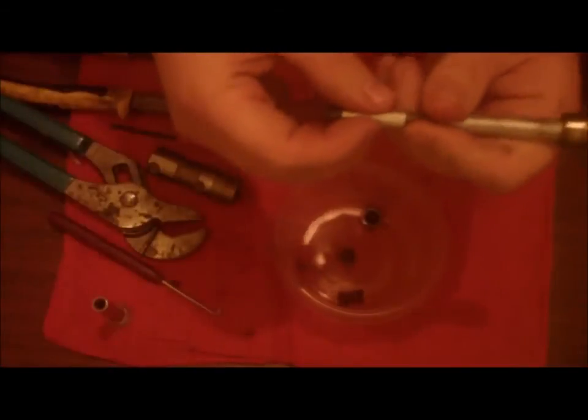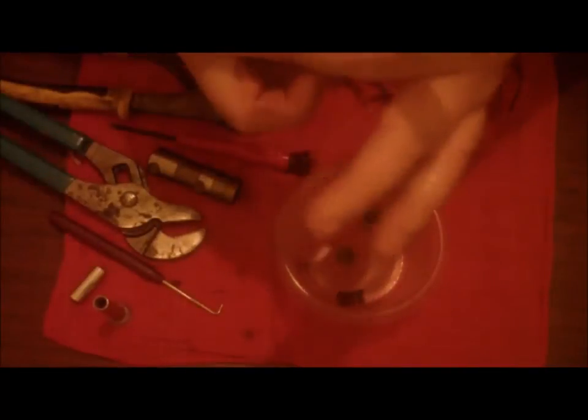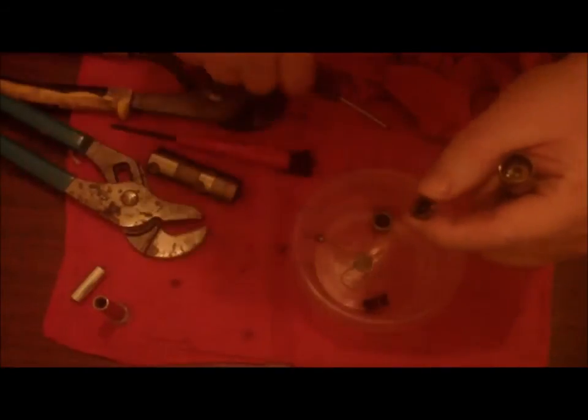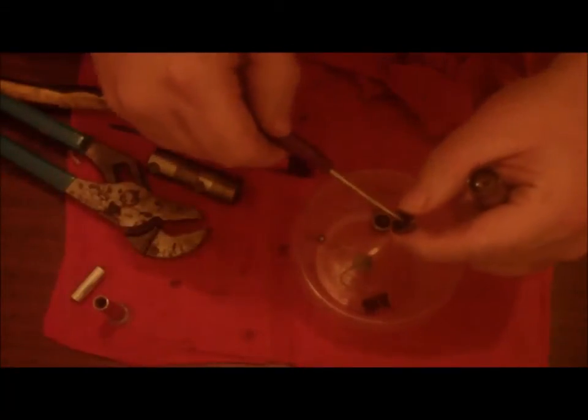Set this part here. This end isn't going to come out on its own, so this is a good time to pop the end off with the hook. Just look at it, find the slot, and pop that off — throw it in your bowl. There's a little steel ball, and a little spring is inside here. You want to take that out, set the spring there, pop that out, and give it a quick wipe down.